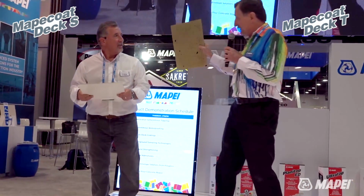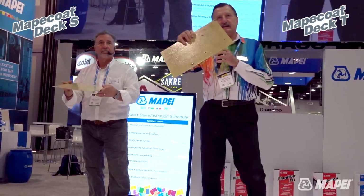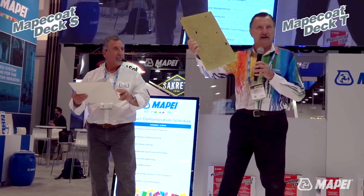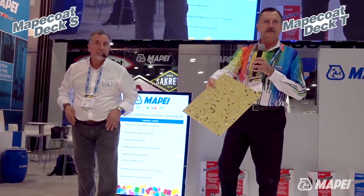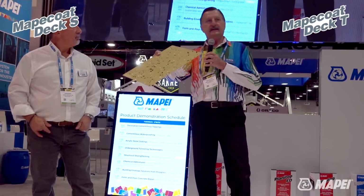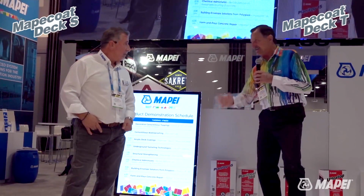And here's a good example. Again, in the booth space, we've got these boards out as well. But you can feel in here we've incorporated a silica sand to improve the slip resistance. I've also introduced a little bit of color, to give it a more variegated finish. And then, of course, you can even do the traditional vinyl chip broadcast, and then that's sealed in with the gloss finish as well. So a lot of variations, a lot of flexibility, a lot of versatility with these coatings.